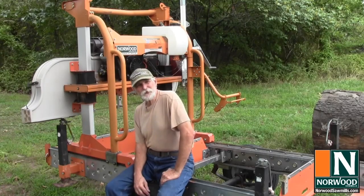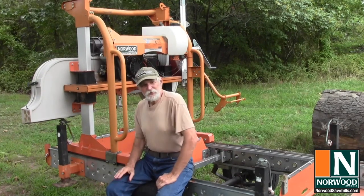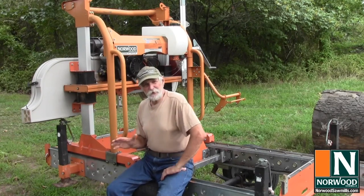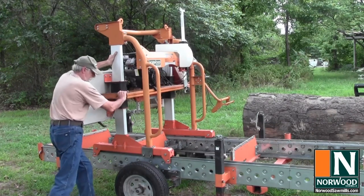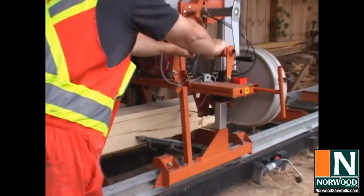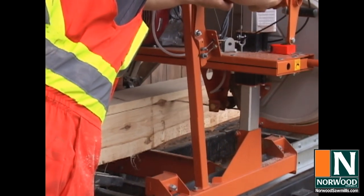So let's look at some of the features to consider when you're looking for an entry-level bandsaw mill. Cheaply built mills skimp on the materials and they're more lightly built. You should be able to push against the mill and feel it just rock solid — that means it won't shake or shimmy when you're cutting your wood. To get a straight, consistent cut, you can't beat laminate construction with overlapping metal plates holding the saw head steady.